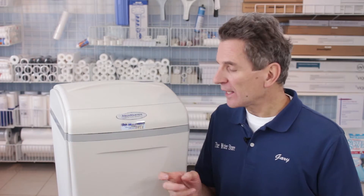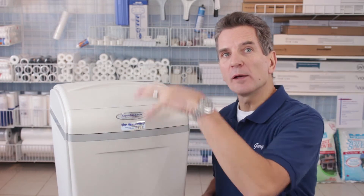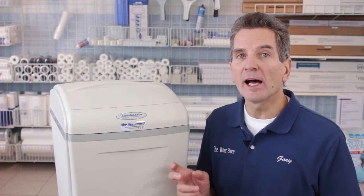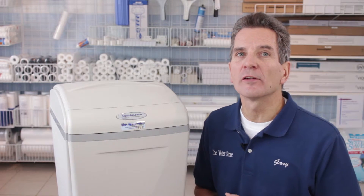Reliability, I rate it a 9 out of 10. It's super reliable and gets the job done. The only reason I don't rate it a 10 out of 10 is that because it's a one-piece water softener with a tank within a tank, they do tend to salt clog fairly readily. And high efficiency water softeners salt clog even more often than a standard efficiency one.